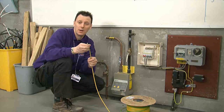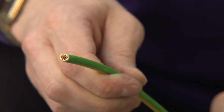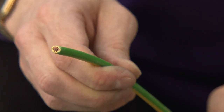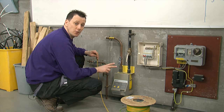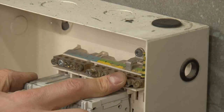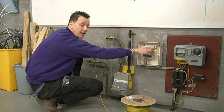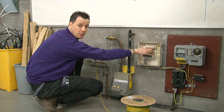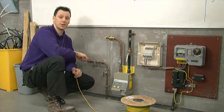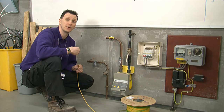We're going to work with 10mm single CPC, or green and yellow cable. One of the rules is that you should not cut the cable between connections. It's possible to run two separate conductors — one from the consumer MET to the gas pipe, and one from the consumer MET, the main earthing terminal, to the water pipe. Alternatively, you can run just one, but the idea is never to cut the cable — keep it continuous.